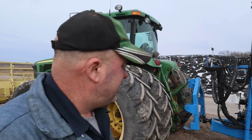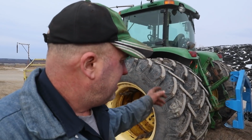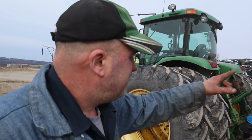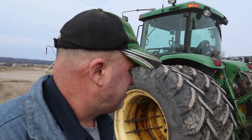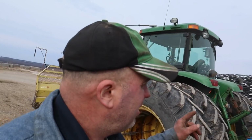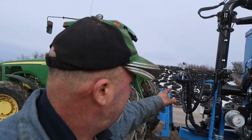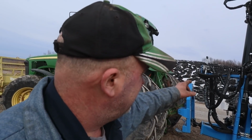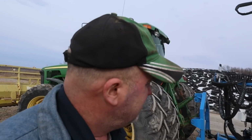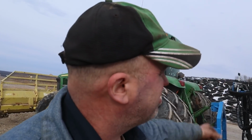This hooked up. I'm gonna take the tractor up. We gotta put fuel in it, and then I'm gonna switch the electric around on it. Maybe they've already got this one set that way, but the remotes will not work unless you have the lights on the tractor, because you have to have power for the receiver on here so that the remote can run the hydraulic to open the valve to let the manure go from the tank to the spreader.